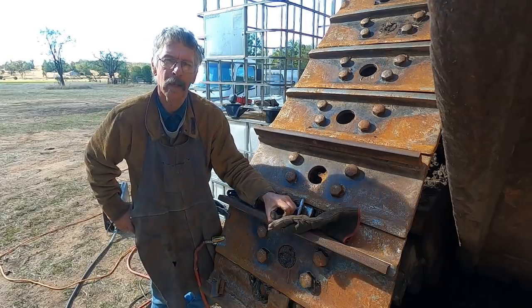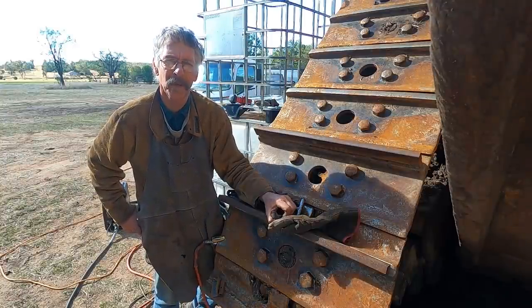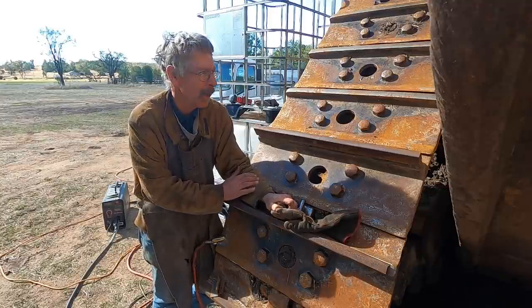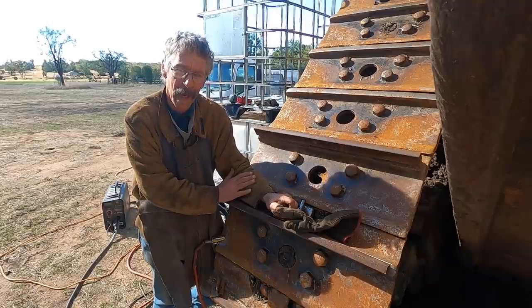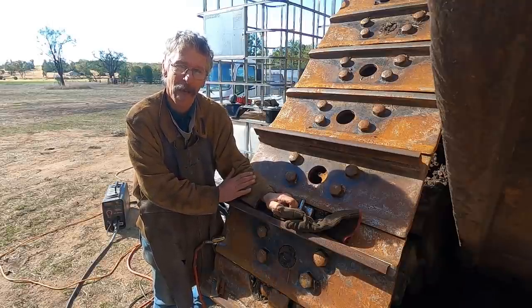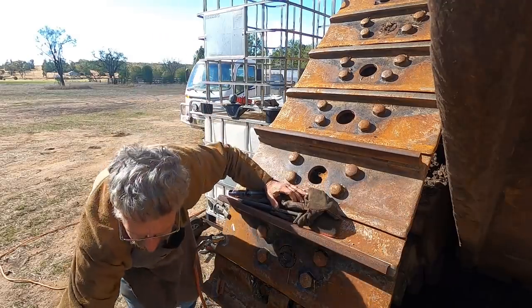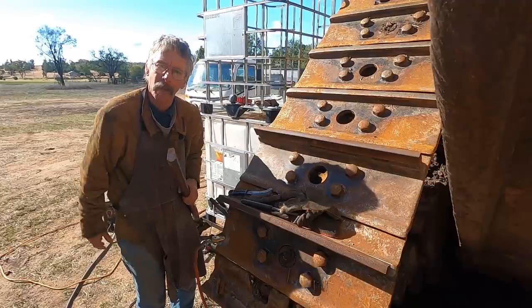Hi there, Peter here. Jacko's asked me to come over and build up the grousers on the D11. From the factory, they're 4 inches, 100 mil high, and these are worn down to 40 mil. So despite the tractor weighing 100 ton, it can't push. You've got to have plates. So these are the bars. They're 60 mil high, and there's a V prep for welding.